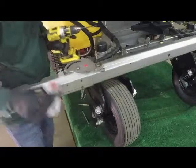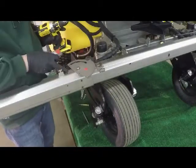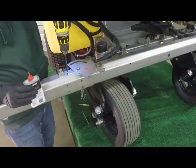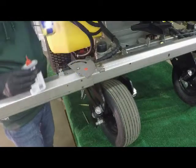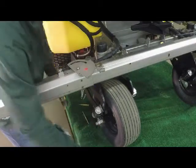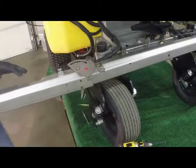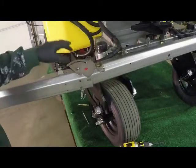Again, you can slide this cam out of the way, add a dab of penetrating oil there, and run your high-speed steel drill bit. Low to mid RPMs with light pressure. When you get done, take the burr off the top and on the bottom if there is any. And these 3 holes should be good. I'm going to stop the video now and we'll go to the next section, installing the other plates and the motor.